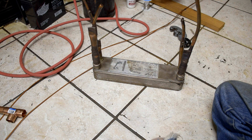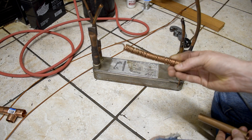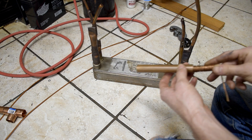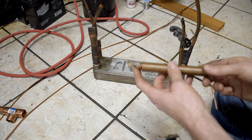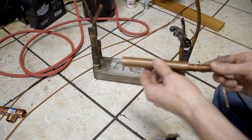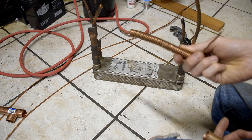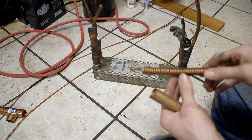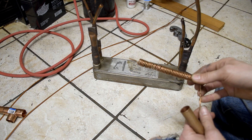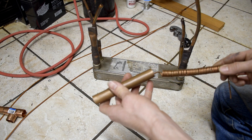So I had an idea — we got a tube like this and a coil like this, so we just put this inside there and it's a tube-within-a-tube heat exchanger. But my idea was to have two of these — this is one eighth inch tubing by the way — we get two one eighth inch tubes and coil them up together, so we won't have a counter flow or a parallel flow heat exchanger, it'll be a dual flow heat exchanger.